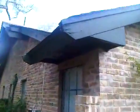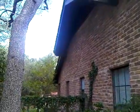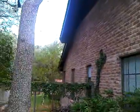So here, this is what we see on a lot of the corners. So we got to cut that off, replace it with lumber, seal it, and then do our fascia overlay system. But pretty much all of these extended corners here that go out beyond the shingle line are in some way, shape, or form compromised or rotted. You see up there too on that peak. So all those areas would be replaced, cut out, make sure that the rot is gone completely, recapped with a 2x lumber, and then all the areas would be wrapped in the hardy siding.